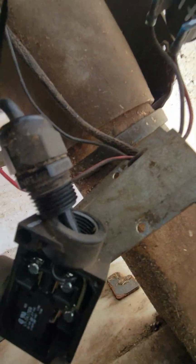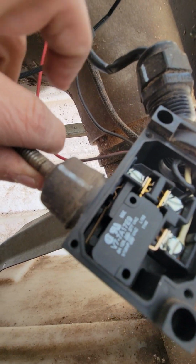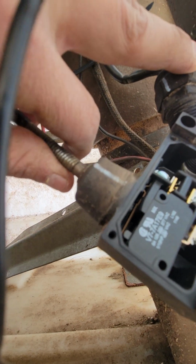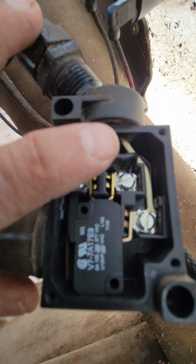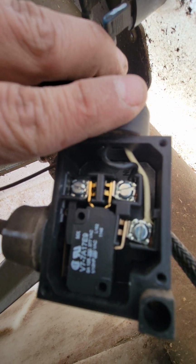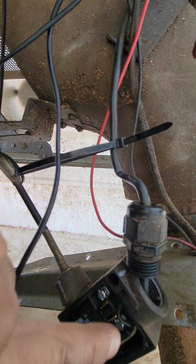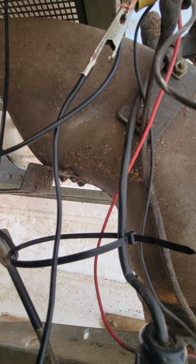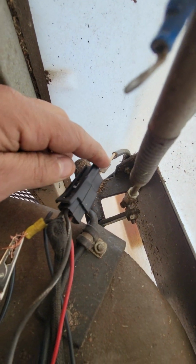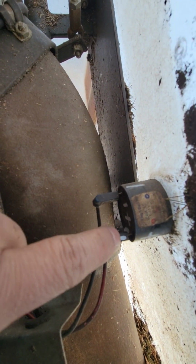So this one, when it activates, look. Check, this is the diagram. Ground, hot, ground, hot. When it activates the circuit, it sends the power with the white cable. Okay, makes ground. There's a white cable that is hot. It comes right here, and it continues the hot. It is white here, red here, continues the red until it ends on the positive post. I don't know if you can see it.